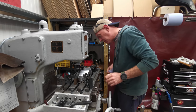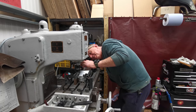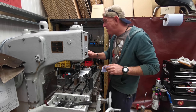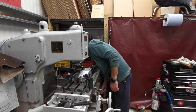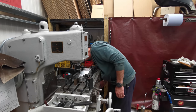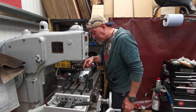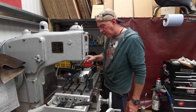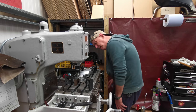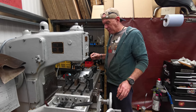So we're just on this back corner. Here's a lovely radius. Those cutters do a brilliant job. Really, really good. I'm running at 740 RPM. Feed speed is probably slow. I'm doing 1.43 inches per minute. I could speed it up, but I don't really see the need. I'm getting a lovely finish on it. It is all going to get dressed up again anyway, because I've got all these surface scratches and everything else that I need to take out, but I'll get a picture and stick this up once I'm done.